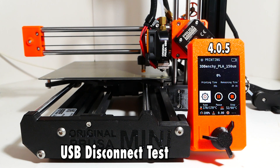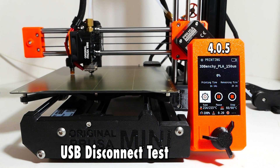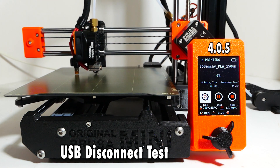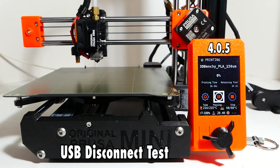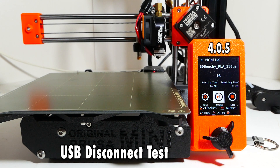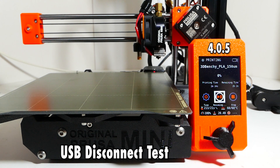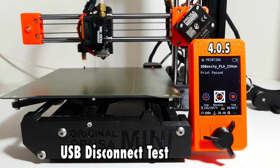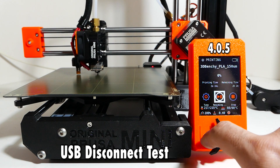The printer is now heating up both the nozzle and the heat bed. Once done, it will start with the usual bed leveling sequence and then the print itself. The printer starts the print sequence and after letting it run for a short while, I pull out the USB stick. As expected, the machine pauses and parks the head toward the back right-hand corner waiting for new input. I put the USB stick back in and hit resume — but nothing happens. The machine goes back to the last print spot and just freezes there. Nothing happens, the click wheel doesn't respond, and in the end I have to hit the reset button to get it started again.